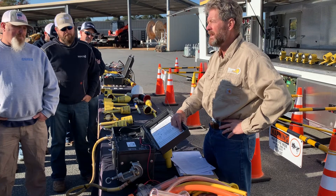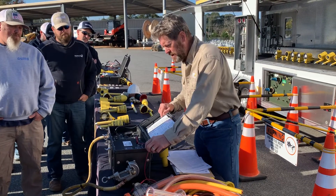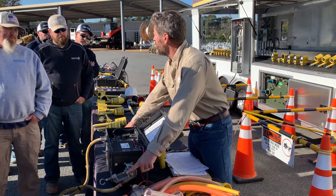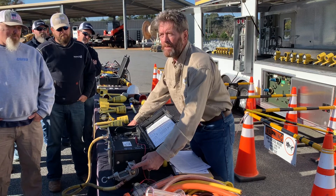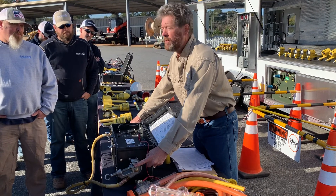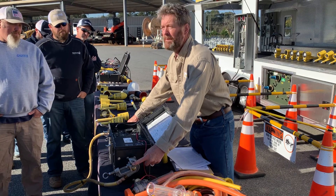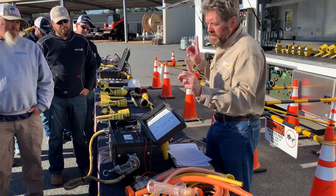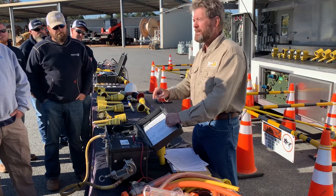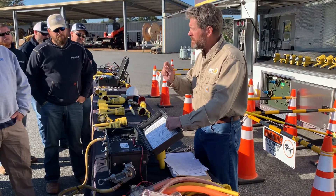If it didn't pass, just barely, there's hardly any voltage so the shock potential is not there, but there is a little bit of warmth at these connections. These connections are not brushed or clean. Make sure when you're using your temporary personal grounds that those connections are clean — they'll work better. From coast to coast, I've encountered utilities that do not test their personal grounds — some that never have.